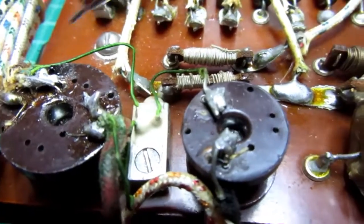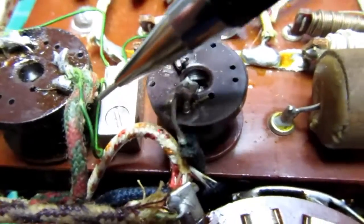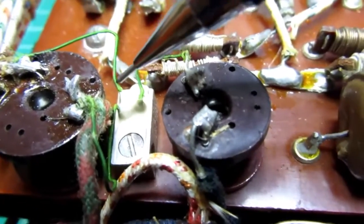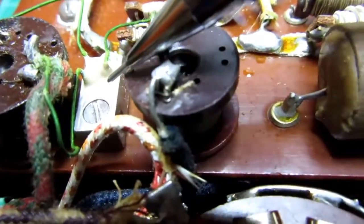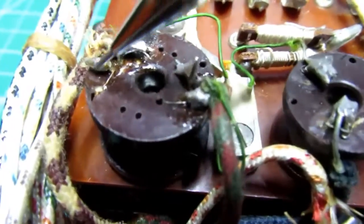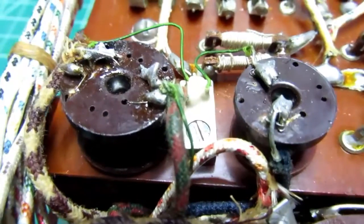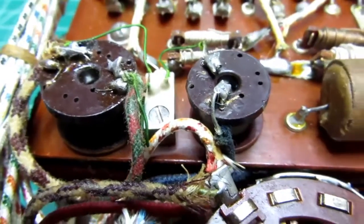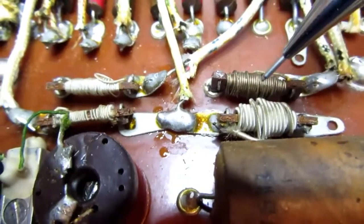The positive of the diode comes out one side to the resistor, and the negative of the rectifier comes out and goes to this resistor. So the positive lead of the rectifier assembly goes to this side of the bobbin resistor, and the negative side of the rectifier goes to this side. And then these 2 wires here ultimately make their way across the coil of the meter movement to act as the shunt. But of course they get switched into it. It's not always connected to the meter. And these 4 are wire wound, but again it's insulated resistance wire.